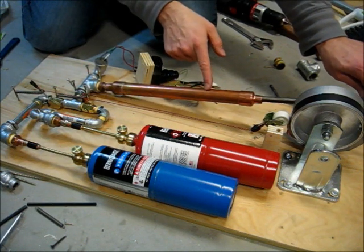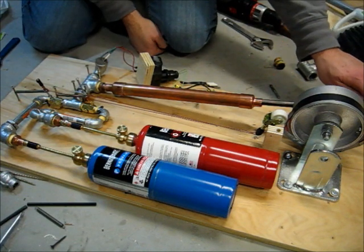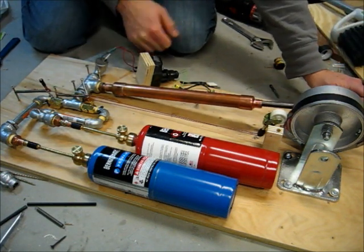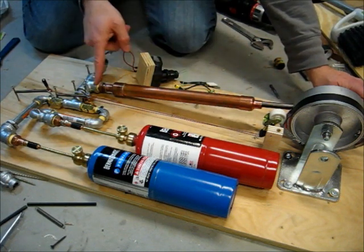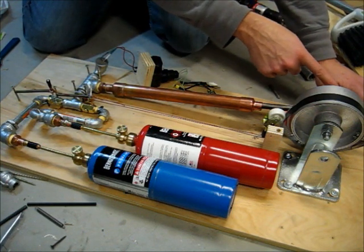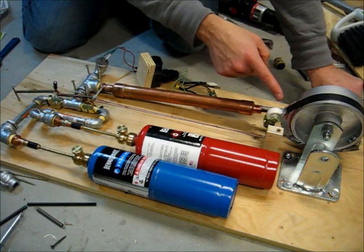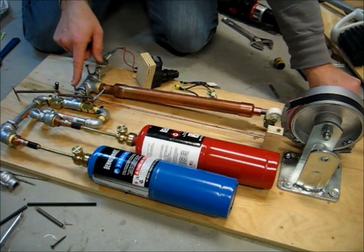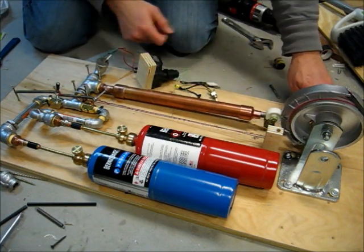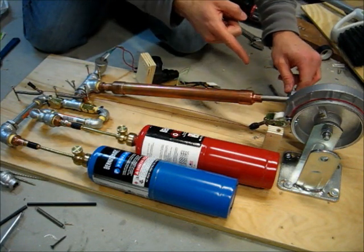And then exhaust, right there. The cam — which I've just taped a large piece of foam on the outside of this wheel to make a cam — it pushes on this wheel, which pushes on these wires that open these valves. Just past what you'd call bottom dead center, these two valves open and hold them open for the whole cycle going back. Then finally it lets go, and it's ready to spark again right there.